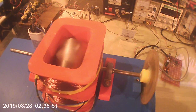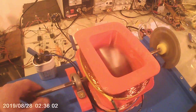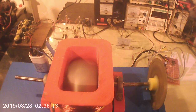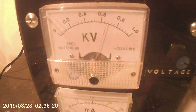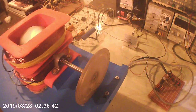That's why the input current drops so low and that's why it's almost a perpetual motion machine — when you get it up to a stable RPM it'll produce a modest degree of torque for almost no electrical input whatsoever. Holding the shaft down changed the gap between the input and the output voltage to such a degree that it didn't help the situation. So here we are again — it's running along at 640 volts and about 6 milliamps. Under load if I give it a bit of a squeeze, the current will peak up to about 8 or 9 milliamps and I will actually be able to stop it at that level, but only just.